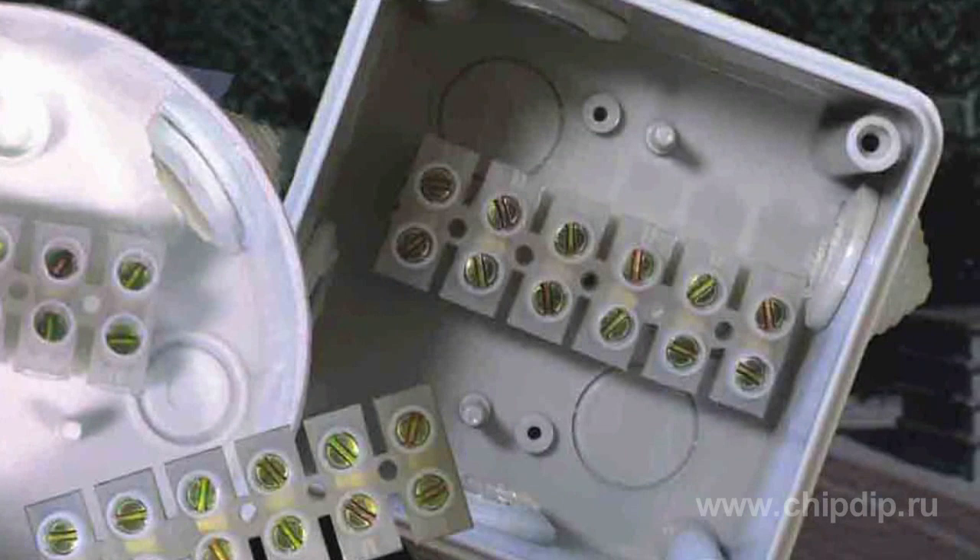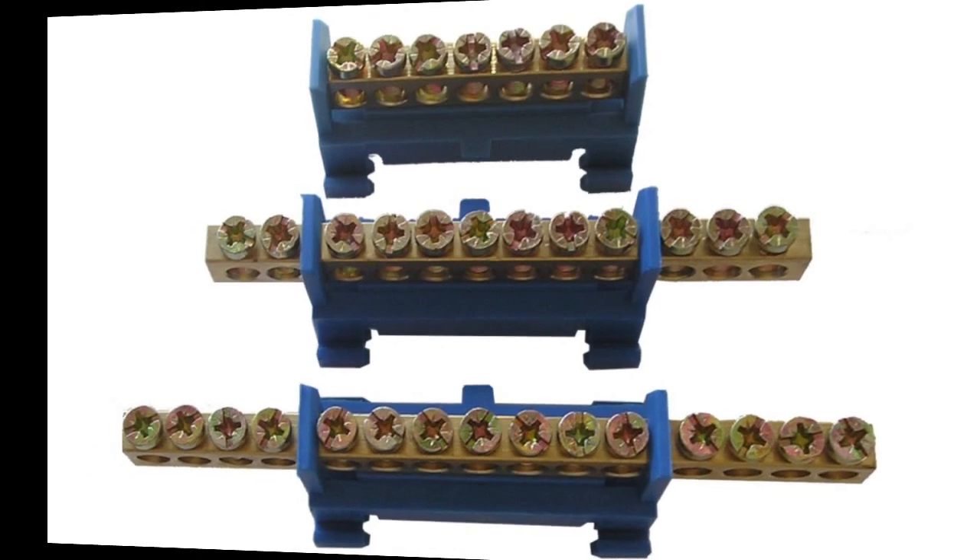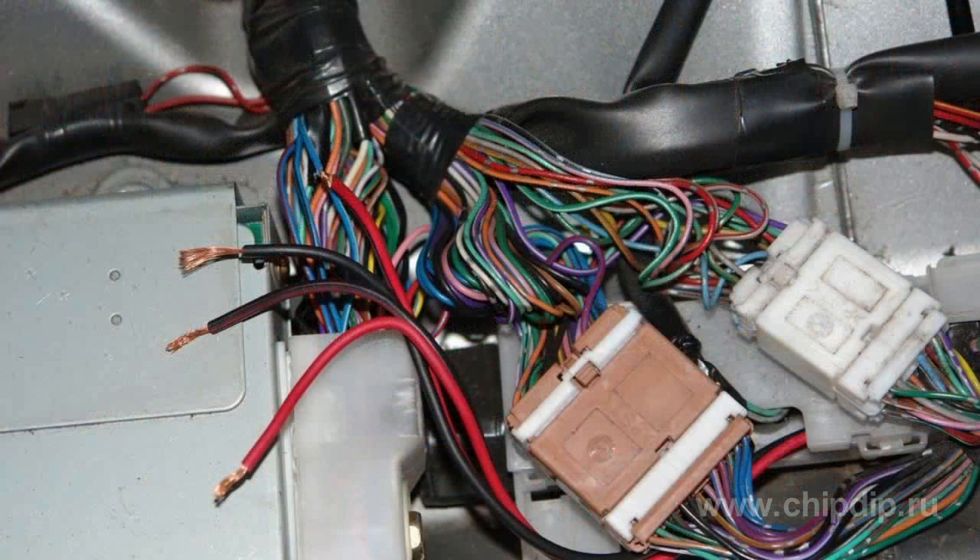Firstly, this includes the usage of clamp clutches of the post-mounted type. They are released with the clamping lath for fixing multi-core wires and without the lath to connect single-core wires. Have in mind that when you use the clamp clutch without the fixing lath, the ends of the wires must be pressed by special tips. Otherwise, the fixing screw destroys the separable cores of the wire, which decreases the cross-section area of current passage.